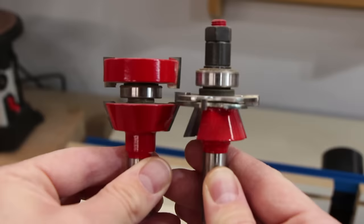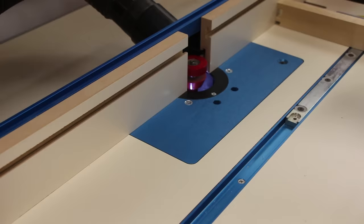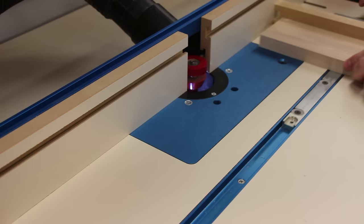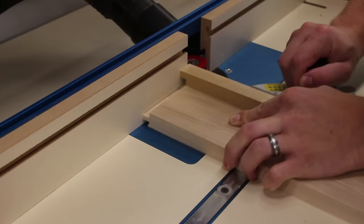Since we're talking about tear out, I have another tip for the router table. I find I get the most tear out on the router when I'm doing something with a complex router bit like a rail and stile bit. This happens especially when you're going across the grain because those fibers are going one way and your router bit is going the other, trying to pull those fibers and tear out the back of your board. The tip is to create a zero clearance insert — take a sacrificial board and cut all the way through it with your router bit. Then when you put your actual piece on to cut, it will cut through nice and clean.